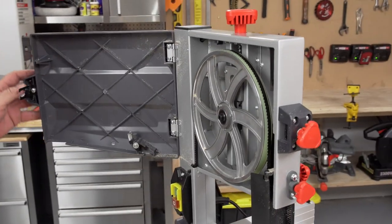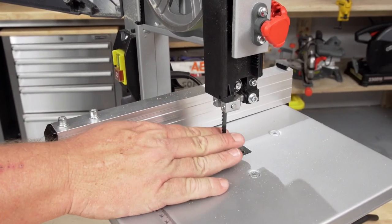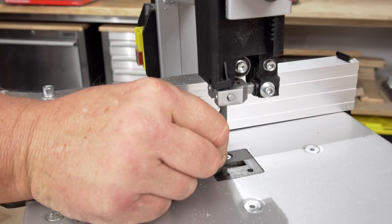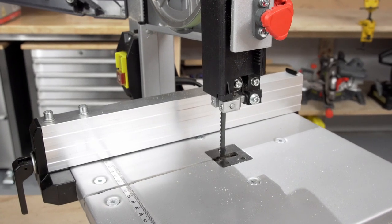Make sure it's securely shut when you close it. The blade tension knob on the top that we talked about earlier will adjust how much tension is in this blade — how much wobble you've got from side to side. You want to have no more than 8mm, but as little wobble as you can get is better.